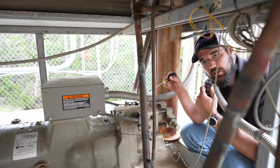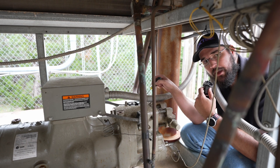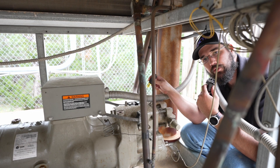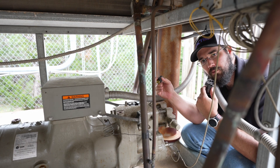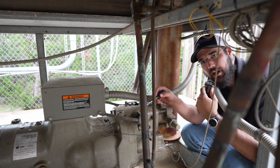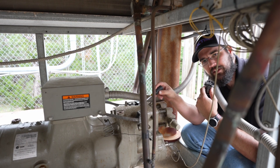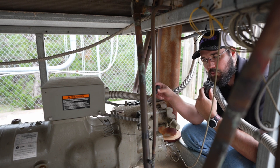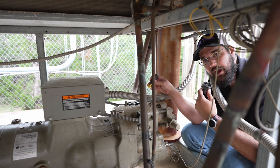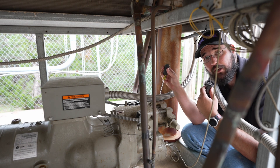We've got a couple of loading solenoids here. We have our female unloader. We also have our two male loaders — the furthest one back is your load valve, and the closest one is your unload solenoid. At startup, part of what I want to see is for the first little bit of runtime, the load valve is going to de-energize. I also wanted to see the unload energized. I wasn't really paying attention to my female unloader because I don't have that many issues out of them — it's not a go-to for me. But I did verify that my unload was activated and my compressor had gone as far as it could go.